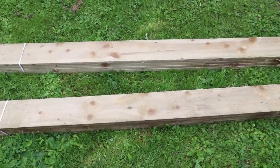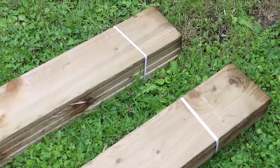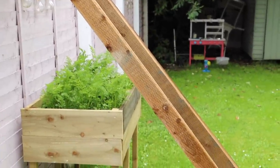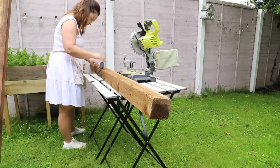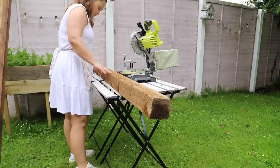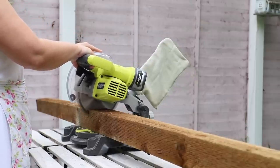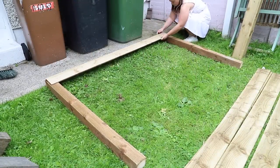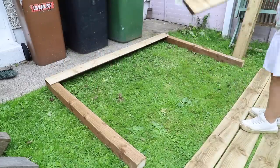I picked up two packets of treated timber panels from the builder's yard at B&Q. I also picked up two posts — there's no reason why one of them is bigger than the other, it's just because that's all they had left in stock. The first thing I did was measure the two posts to size. I can put the measurements for my wheelie bin cover in the description, but it's going to be unique to yours depending on how big and tall your trash cans are. So I measured my trash cans: the length, the width, and the depth before cutting all my pieces of wood to size.